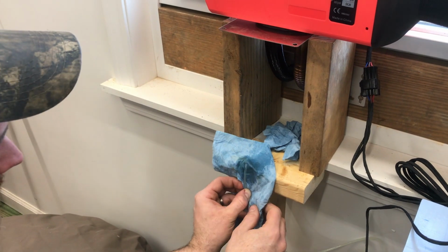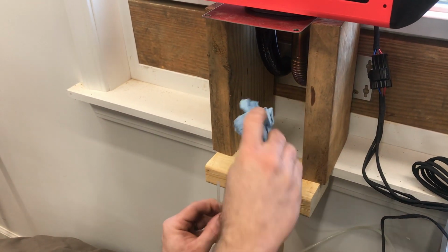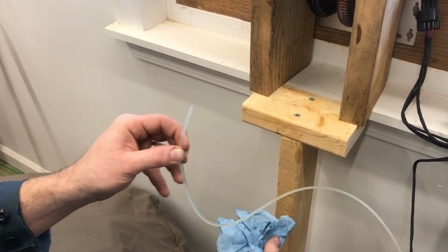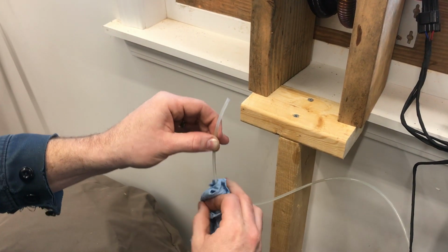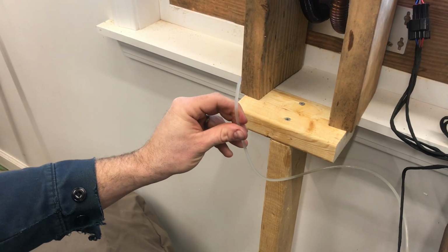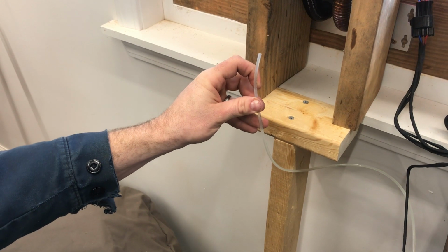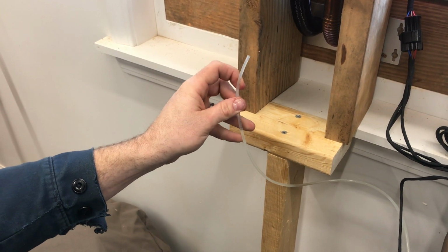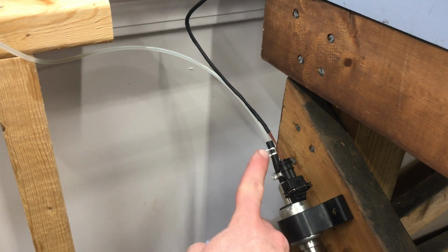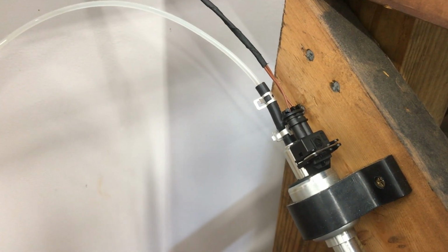So what does it matter if it's shooting out like that as opposed to the way it was? I would say that whenever that fuel hits that atomizing screen, it'll atomize better, so you get a better burn. A better burn is more efficient, and if it's more efficient, it should take less fuel to get the same amount of heat. What size fuel line was that? 2mm ID, 4mm OD, and that's used after the fuel pump. We used that green soft stuff coming in and then little black rubber lines to connect, and then we'll run this hard plastic line on into the heater.